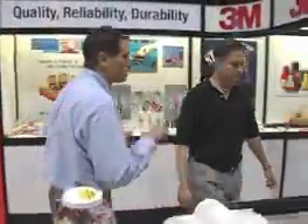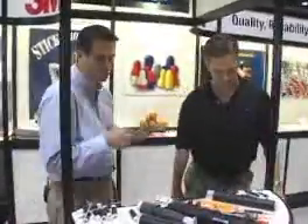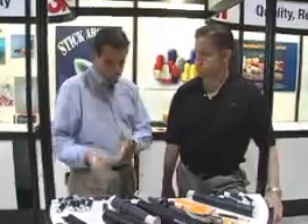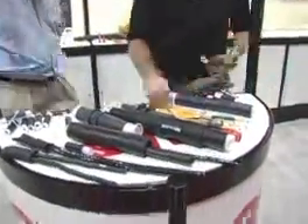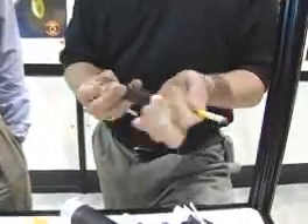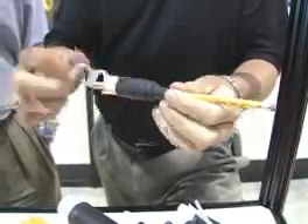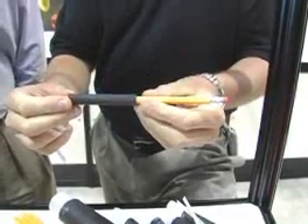Now there was something else over here — this is a great new answer for insulation. You showed it to us earlier and I just had to bring our crew back here to show them what you showed us. You've got a lineup of product here — just show us again what you did. Well, 3M, we're really big into insulating technologies, and everybody's familiar with heat shrink. What we have here is a technology called cold shrink, and cold shrink's been out for over 25 years now. The nice thing about this is it will collapse — if that was your cable that we were doing and re-jacketing up — we pull the cold shrink core, it's a pre-stretched tube that collapses down.